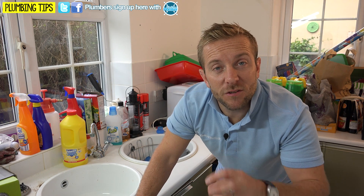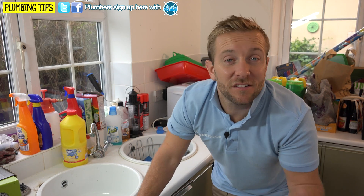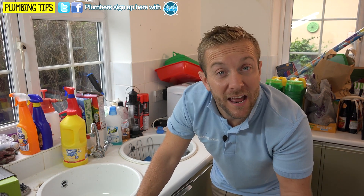A Home Boost Pump will maintain a static head of about 1.6 bar, but if it starts to flow, it'll give you about 1.5 bar around 12 litres a minute. The great thing about these is they've got an intelligent way of thinking — if you're just using a small amount of water, they won't just come fully on. They measure the amount of water usage and actually adjust the pump output to suit, so they're really energy efficient.